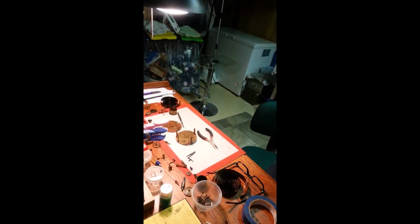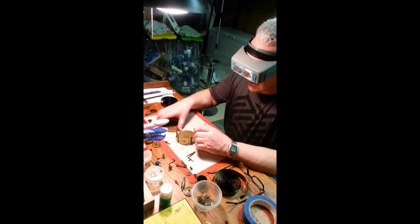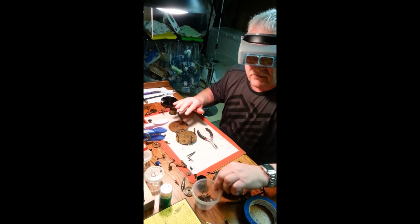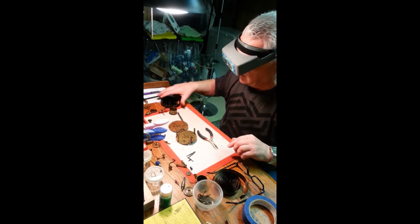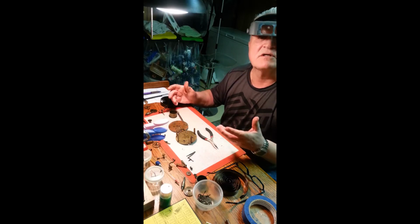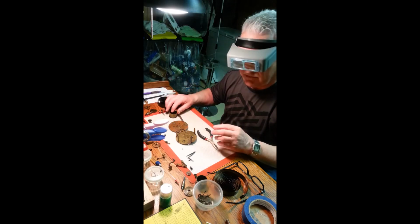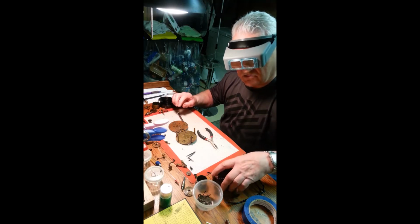Okay, so I thought I was videotaping and I wasn't. So I took the top off of this and I took pictures. And I put everything aside, separated, so all of the strike components are here and all of the time components over here. I also took the mainsprings out of the barrels, so you missed all of that. Just took it out by hand. This is the time side. I keep them separate from the strike side. This is the barrel and the barrel cover. This is the strike side.